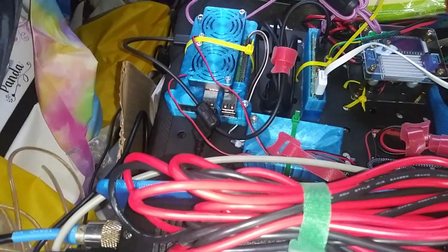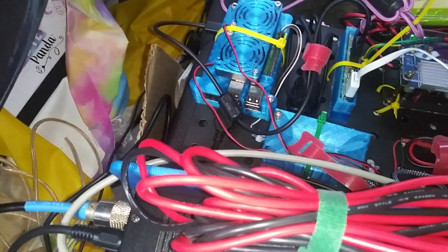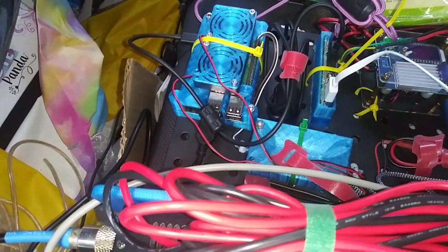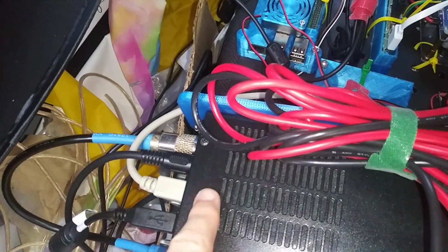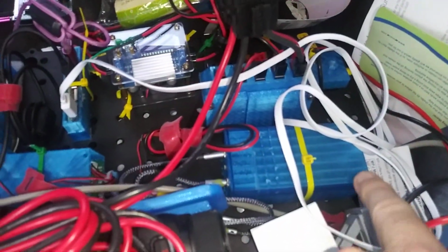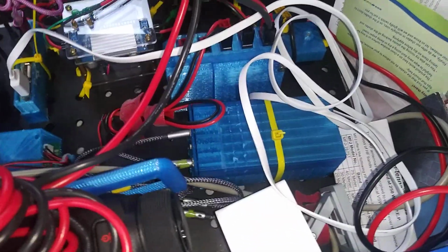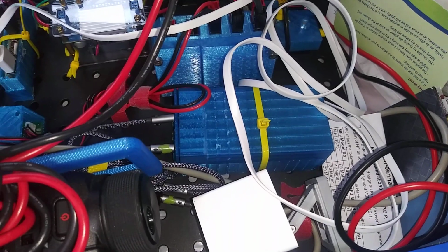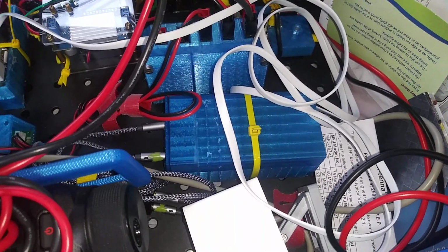I'm using something called Mumble on the Pi. Someone gave me the idea for that. Basically, sound goes in and out of the Pi through the data port on the back of the FT891. To create that interface, I just ordered one of these old PS2 cables off Amazon and spliced into it. The only thing inside this little box, which is way bigger than it needs to be, are a couple of one-to-one audio transformers. I think they're 600 ohms, just to provide some isolation, supposedly better for noise and stuff.